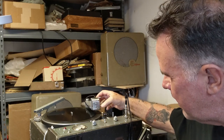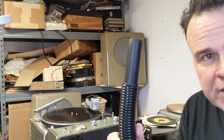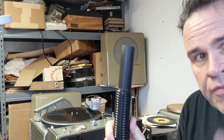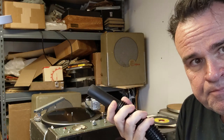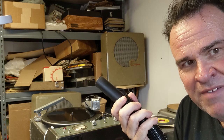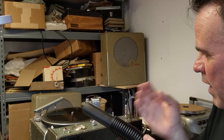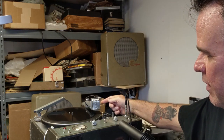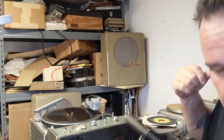Next, I pull the cutting head over, get it in position, and also I make sure my vacuum cleaner here — it's a shop vac — is plugged into the wall. Because when that records, the needle is going to pull up a thread of PVC, and whenever I clean out my shop vac, it looks like there's a wig in there — just a big old gray, black head of hair. Once I get this started, I pull down the needle, and then it starts cutting, and then I will turn on the shop vac, and put y'all on pause a bit while the song goes into the grooves.